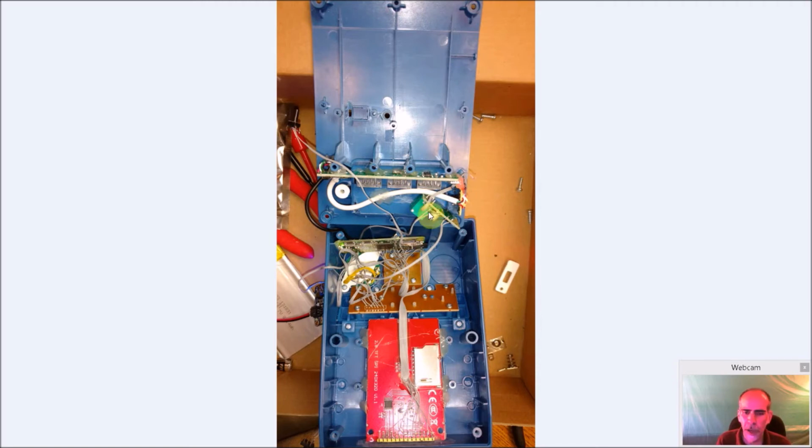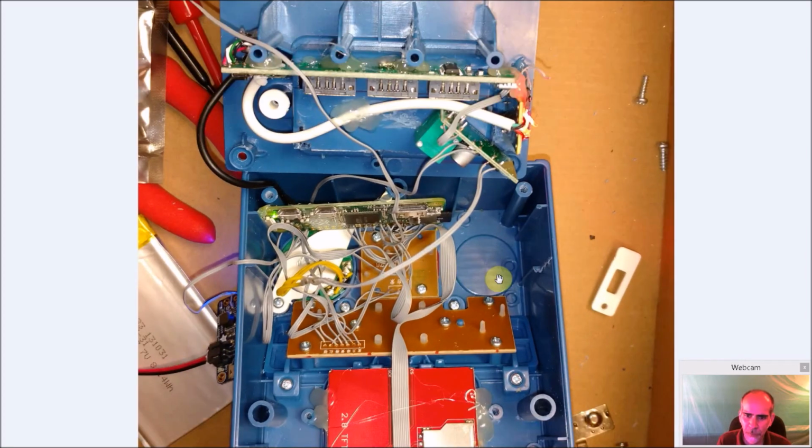The volume control, you have to be careful with as well. You only got this space to work with in here. Again, as long as you get in that zone, you're fine. There's enough room. But the audio out, I measured it should have fit in here, but I was a little bit off. So because of that, I had to trim it down, but it worked out in my favor, I guess. So now when it closes, this will actually offer more support. So when you're pulling in and pulling out the jack, the hot glue will hold it, but in this case, it's giving more support to the back. So it actually worked out fine.